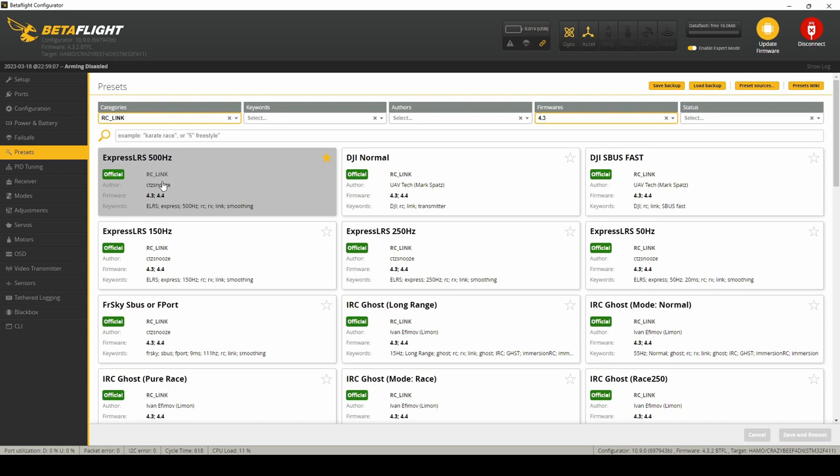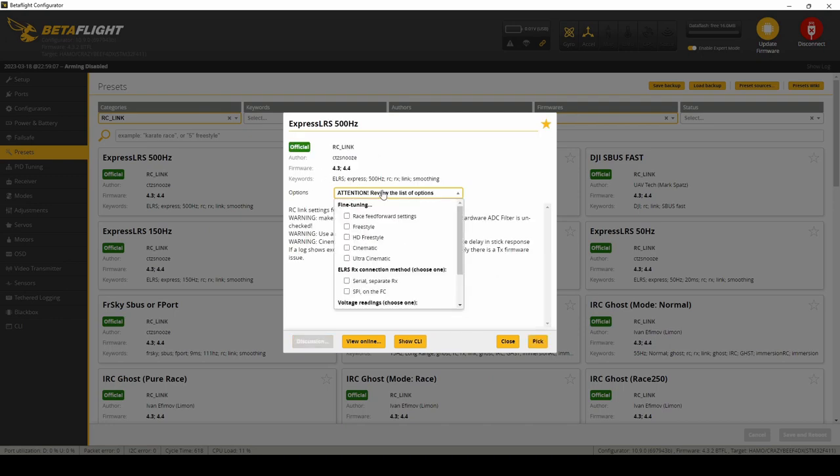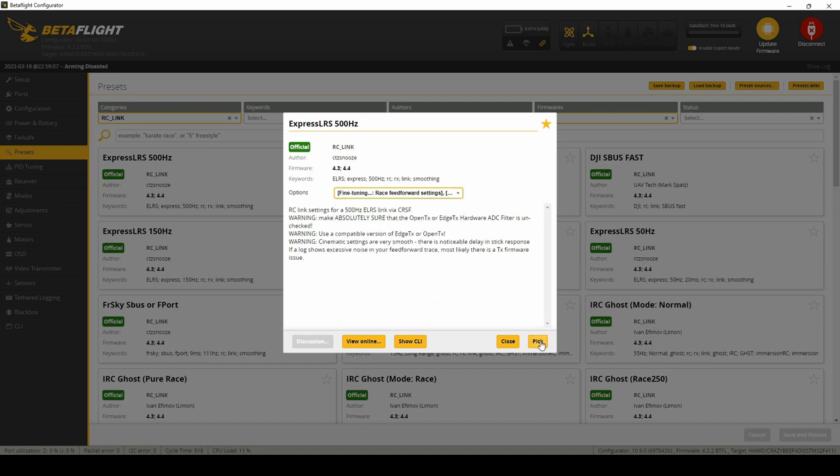Back at the bench: to get stick movement in Betaflight, go to your ExpressLRS LUA script on the radio. When you open it, it may show a Model Mismatch message. Go into Model Match and turn it on, making sure the receiver ID matches — in my case this is receiver number 8, ID 8. Once you do that, the mismatch message goes away and you'll start getting stick movements. In your model settings, page over and confirm the receiver number is set to 8 to match the LUA script.